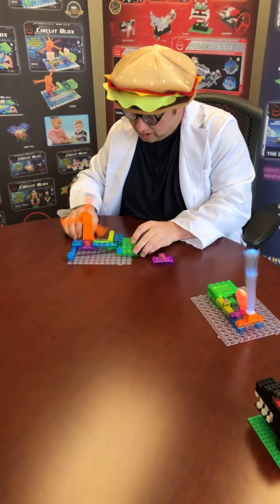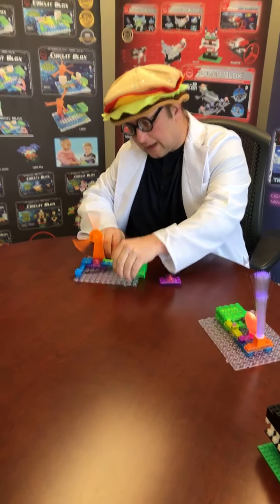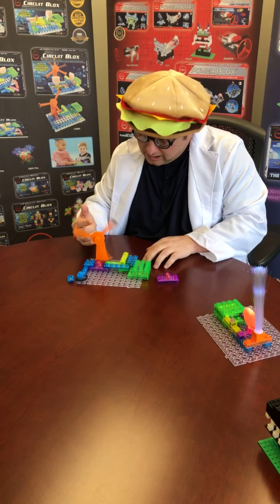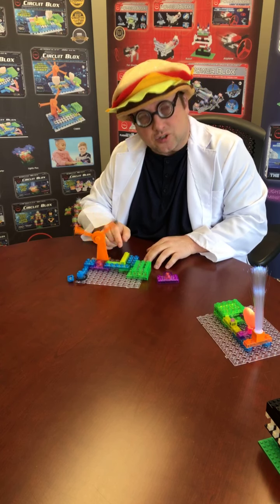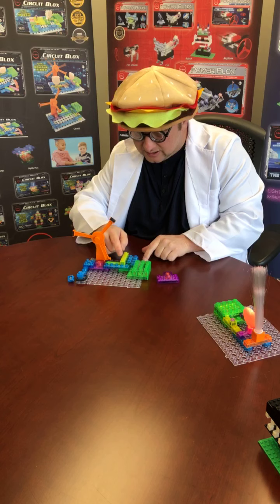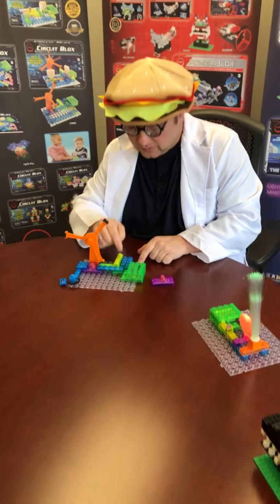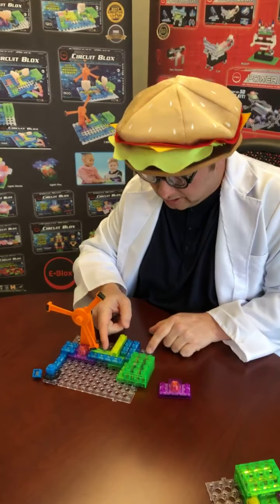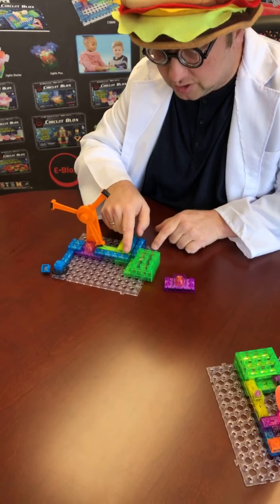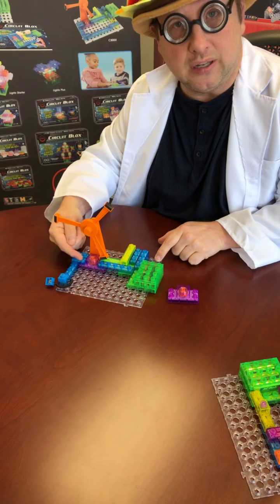If you look at the rest of this circuit, what's actually happening, and I'm going to stop this for now, you see when I disconnect the circuit, it stops spinning. If you look at the rest of the circuit, the reed switch, which is the top 2 connections, is feeding the base of the transistor. Now remember, transistors can act like a switch. And so when a little current comes in the base, that's what allows current to flow through the collector to emitter, and that's flowing through the inductor.